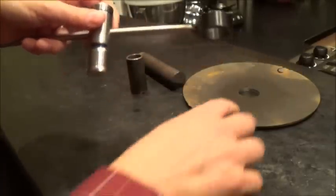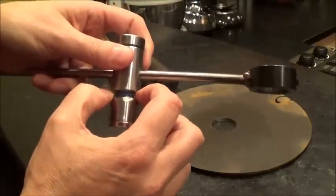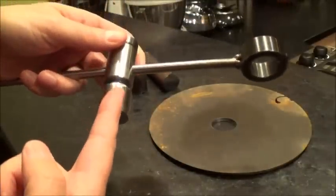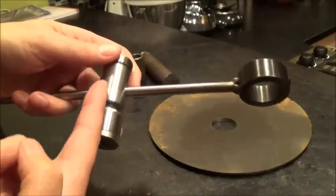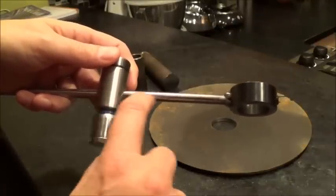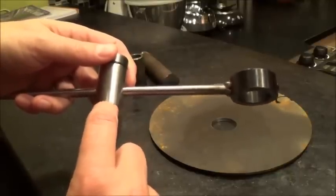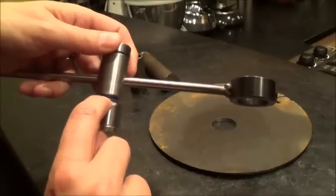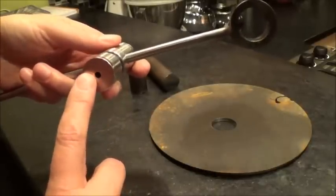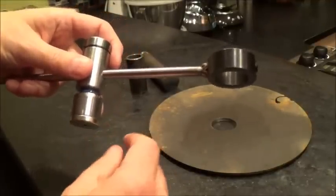The bottom has a hole cut out of the scrap piece that's welded onto the top, and then I drilled the hole through it. A bolt goes through here into the main body, stopping short of the rod going across, and that holds everything together. In between the two pieces are thrust bearings, and on the bottom is a neodymium magnet so that it will stick to the metal and give you a solid center to turn around.